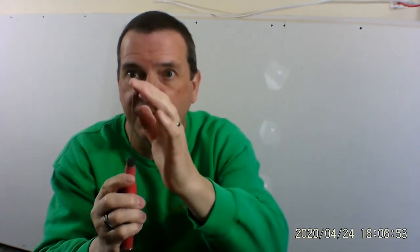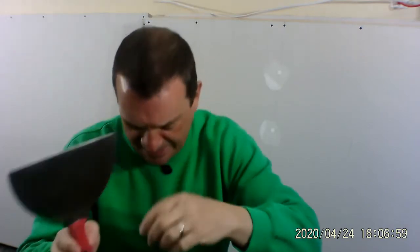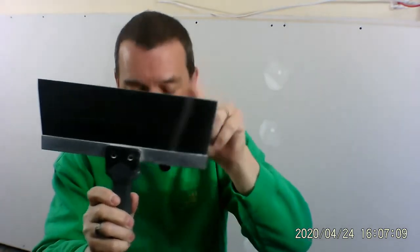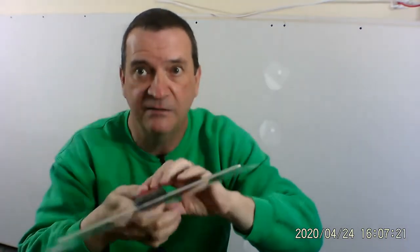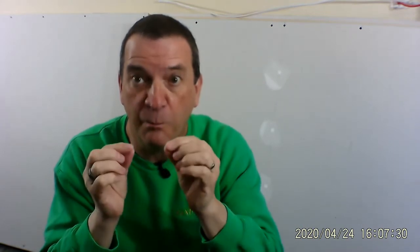When I chose these particular knives, I did the same thing as I did with the pan. I took each knife and looked straight down to make sure it was straight and didn't have any ridges or dings — you want it perfectly flat. When you wash your knives, try to make them look new, because if you leave any drywall mud on them they will pit. You don't want that.